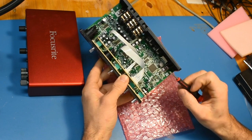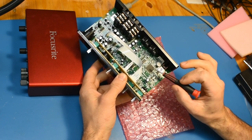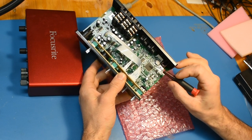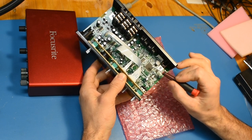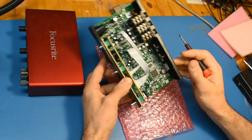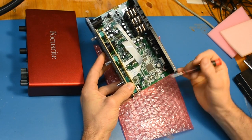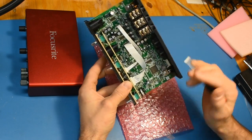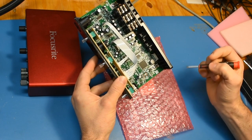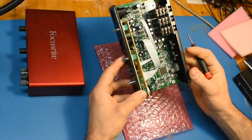For copy protection they have a bootloader with decryption keys. You could copy the EEPROM — there's no problem there — but if you don't get the proper bootloader in there, it's not going to boot. Luckily Focusrite are absolutely great with replacement parts; you can actually buy the CPU and it's about the same price as you'd pay at any regular distributor, so there's no point trying to extract the firmware. You can just order a new one. Or if it's still under warranty, get in touch with them — they're pretty good.